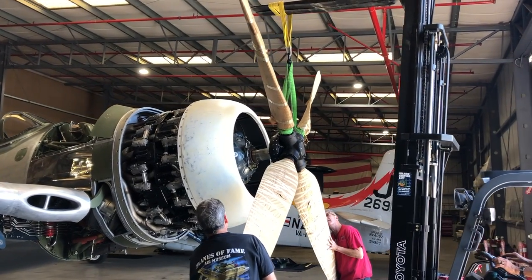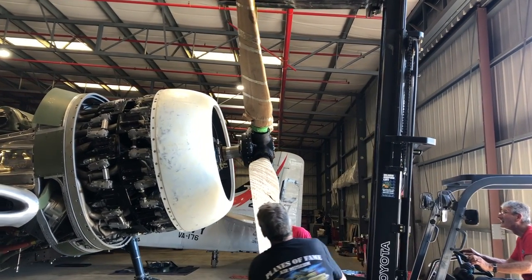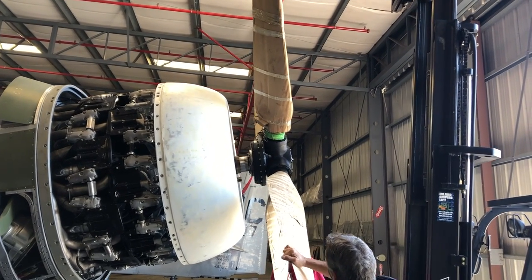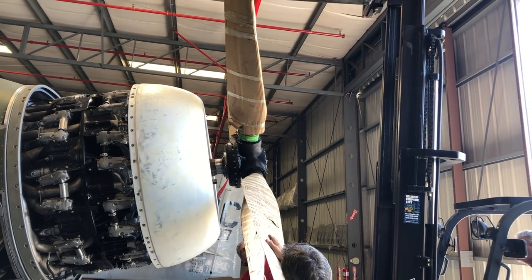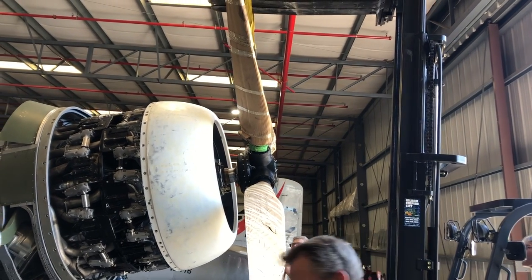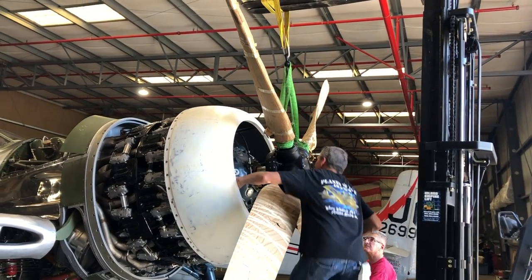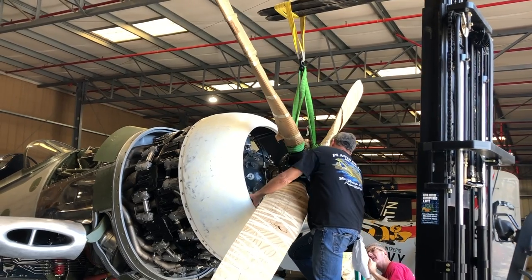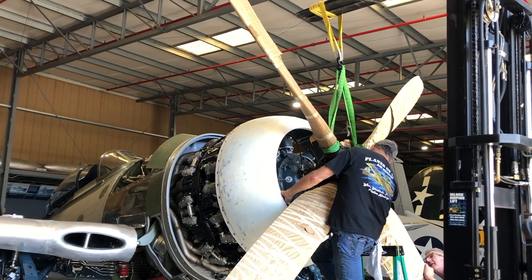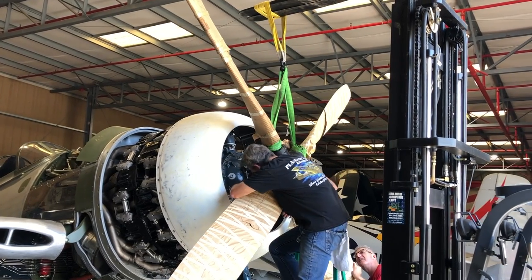That stationary element gives the regulator on the back of the propeller a stationary point, so it runs gears off of that internally — that's its hydraulic pump. The prop lever controls the pressure in the pump, which regulates the RPM. It's a really good propeller. Sky Raiders used them — A-1 Sky Raiders got a larger diameter but same design. P-51 K and H models used them, F-82s, and of course the Aeroproducts C-130 Hercules and P-3 Orions — multiple different aircraft used propellers built by Aeroproducts.